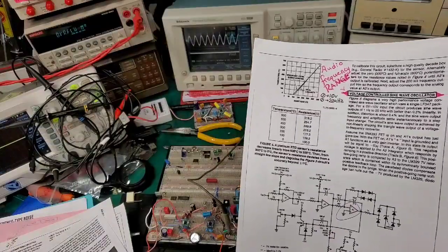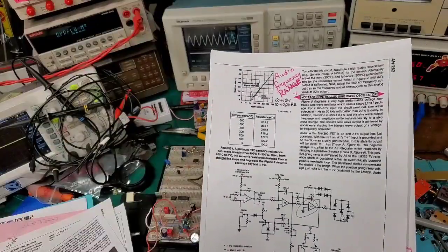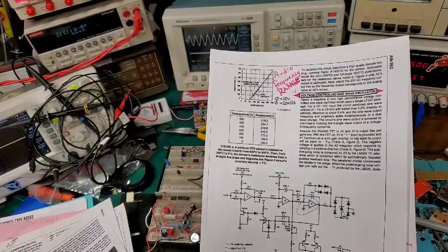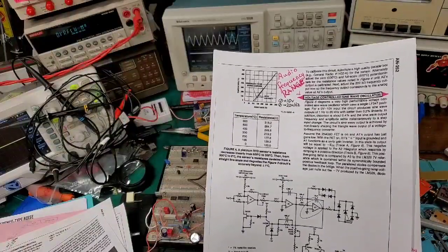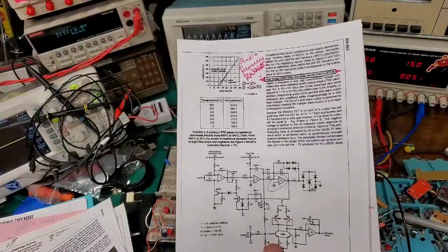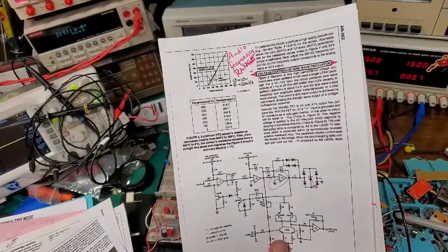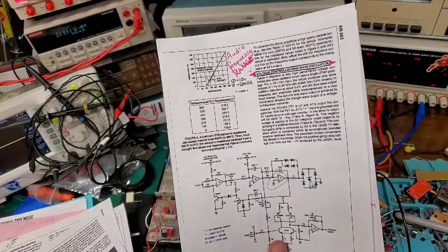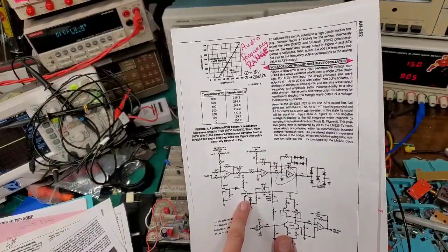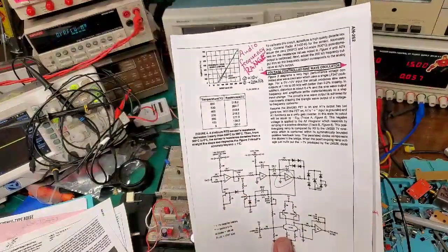And while I was waiting, I just tried the JFETs that I had on hand, like the J102, the J310, 5457 or 5458, maybe 3819. All of them worked. They all worked a treat. And I know a couple of them aren't radio frequency ones. So, anyways, quadruple two worked fine for there.